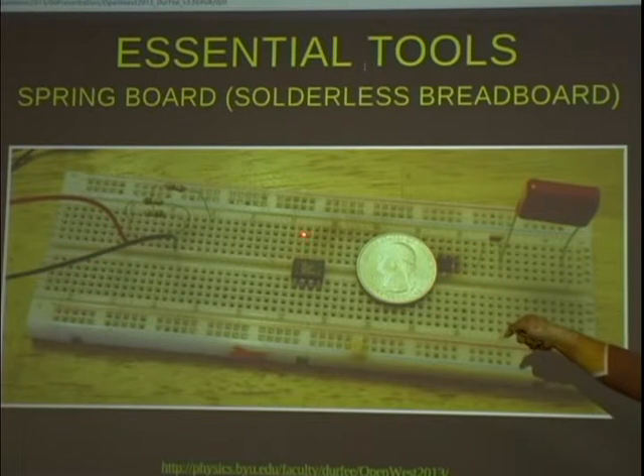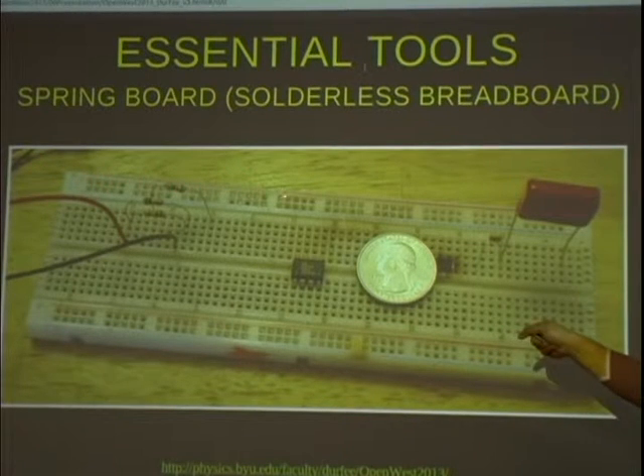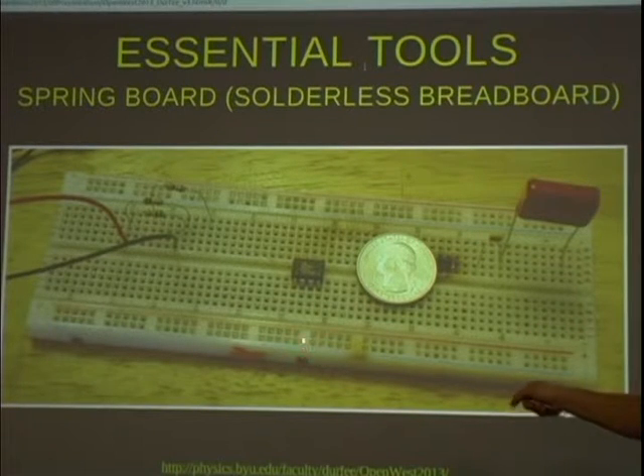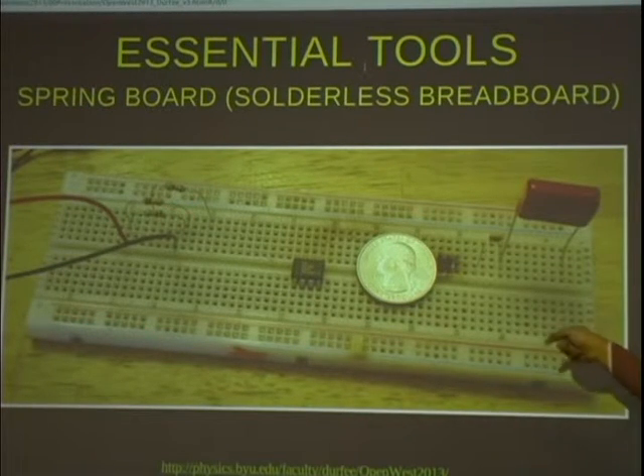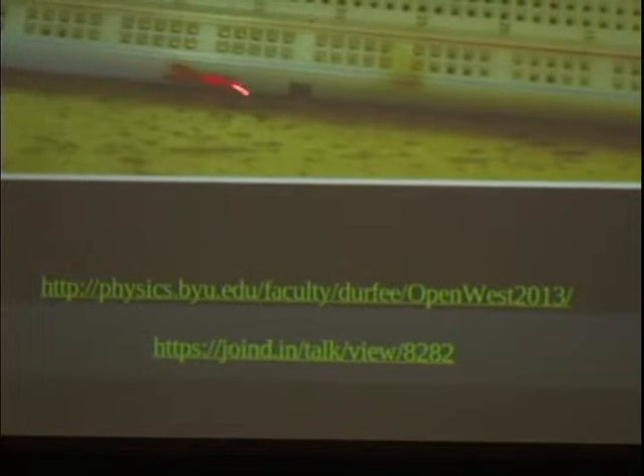The holes don't connect across the boundary in the middle, so these ones are connected to these ones, and these ones are connected to these ones. There are also some buses at the top where you can plug your power supply in, and then all of those pins will be power — they're all connected together. Typically there's a break right in the middle of the buses, so they give you four buses broken in the middle so you can have plus power, minus power, ground, however you want to lay it out. I know people who do physics research and build a device on one of these boards, debug it, get it working, stick double-sided tape on the back, and close it in a metal box.